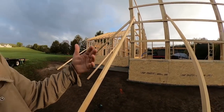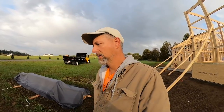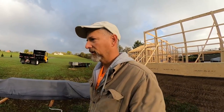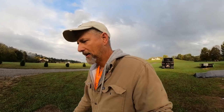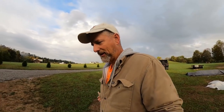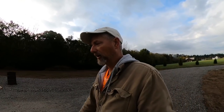And on the other side, I'll have two 200 amp panels. So I have 400 amps total, which I think will service me just fine with all my welders and all my tools. So I think that'll work out great. I have plenty of room to grow. I have to do another new service anyway because my house is maxed out. It's already 400 amps and has a panel in the basement as well. So it's really limited out. Not that we pull that many amps, but the circuits are already there.